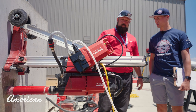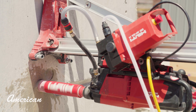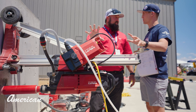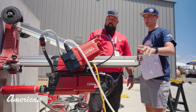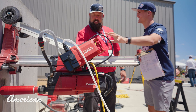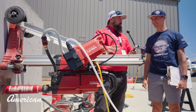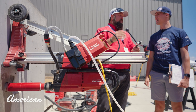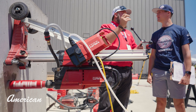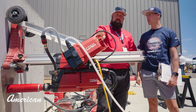So we're at two inches now, it's saying. Basically this auto feed is the brain of the system — it does everything that a person normally would, without fault. We have human deficiency; this doesn't. I don't have to be using the spindle, pushing it hard, trying to keep it at a certain level. There's red, yellow, and green — green is optimal. If I'm in yellow, I'm not pushing hard enough. If I'm in red, I'm pushing too hard. It takes the human error away.